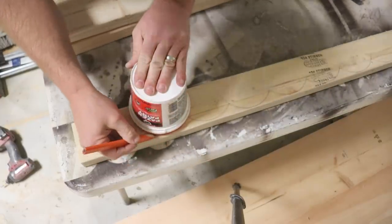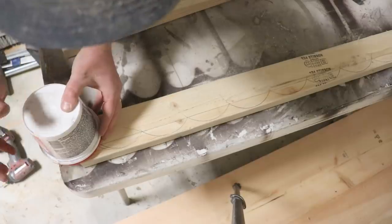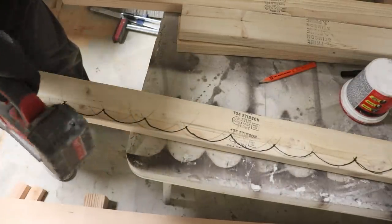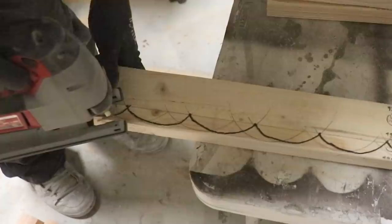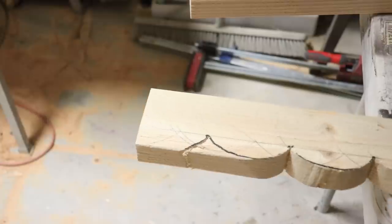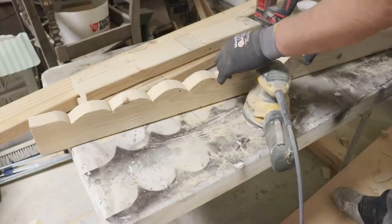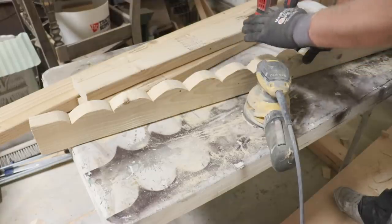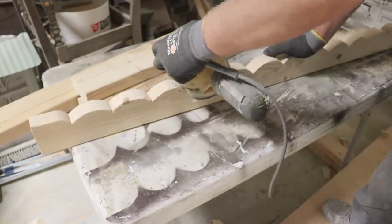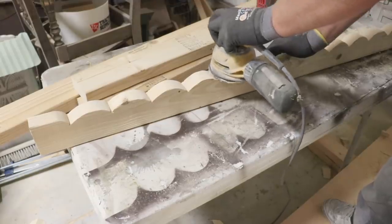The DAP patch and paint bucket has served me well as a tracing template. When I get to the end, I don't want the scallop to go all the way to the edge. I'm going to make all the cuts this way and then come back from the other end and make the cuts that way. This blade makes a fairly rough cut, which is okay — we're dealing with 2x4s here. I'm just going to take some 80 grit on the random orbital sander and remove some of that material, make sure everything's nice and smooth and uniformly round. It took me about 5 minutes to cut this out, so I'm anticipating about 20 to 30 minutes of cutting and sanding to get them the way I want them to look.